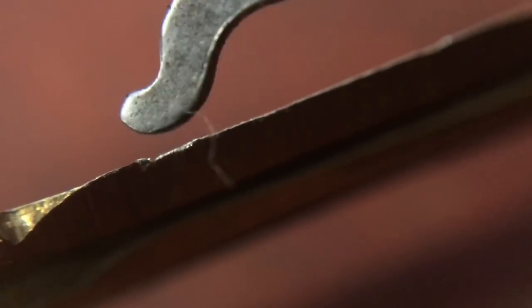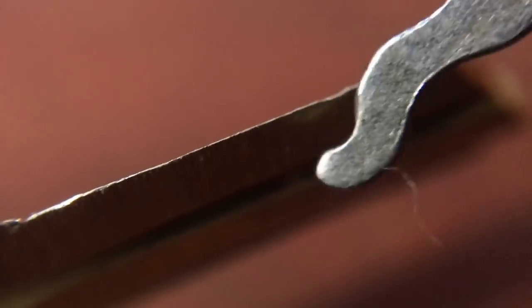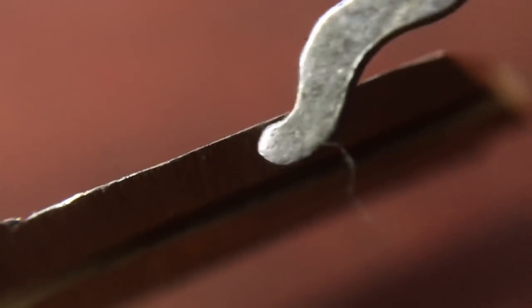We see that first cut that was definitely a 2 or 3, marked really well. If we come down here, we see a 4. You're only going to file what you see. You want to be careful not to cut what would be called a false mark, but we definitely got a good mark on number 1 wafer there and number 4 wafer there.